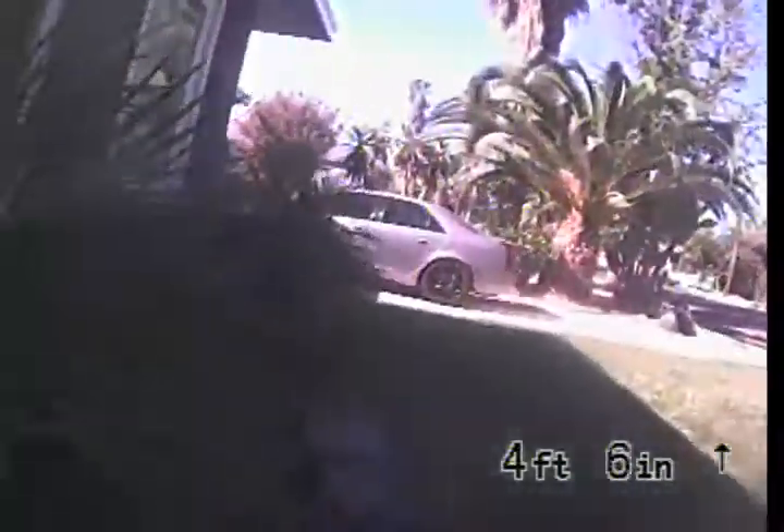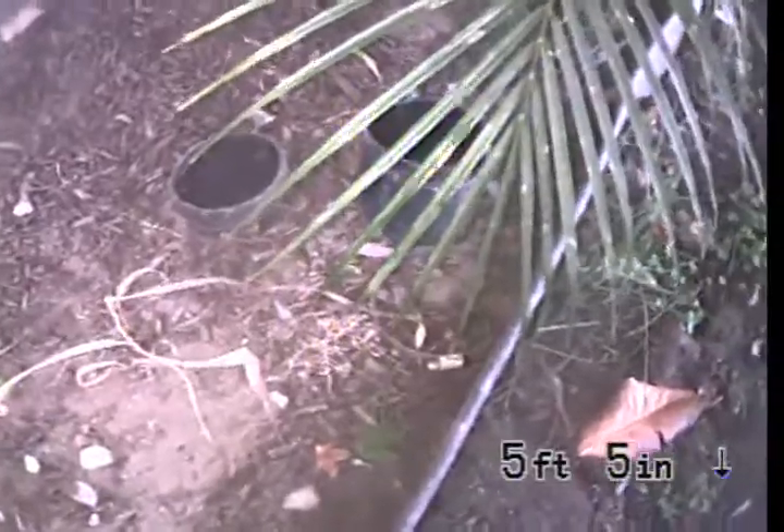When we got here, we accessed a 4-inch ABS plastic pipe clean-out. If your back is to the street, it is to the left of the front door — there it is right there. Quick landmark: the front yard. The only recommendation here, guys, is to do a hydrojet, remove a small section of roots at the city valve connection, and then re-inspect.